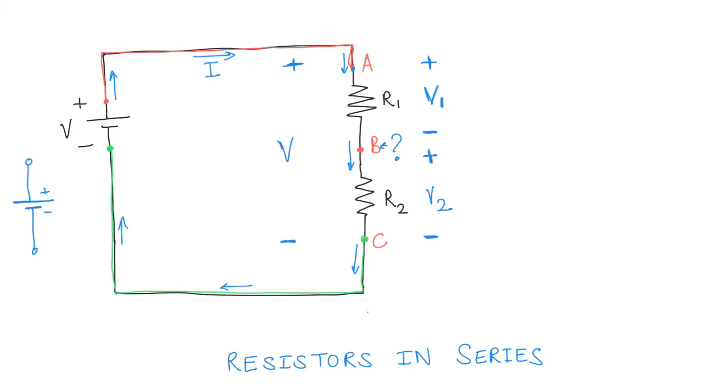Okay, having looked at all that, let's just think about how these resistances actually give you voltage division, which is what they do. So we already wrote in the previous slide that V over I is equal to R1 plus R2, and that of course can be written in terms of the current. Let's just evaluate the current. So I is equal to V over R1 plus R2.